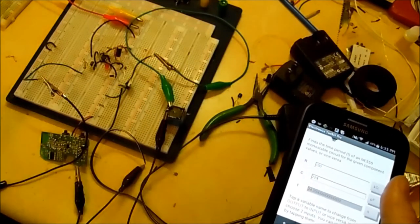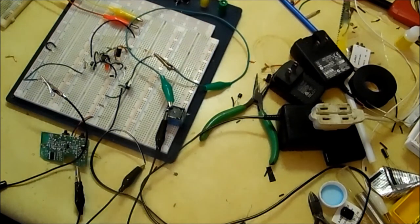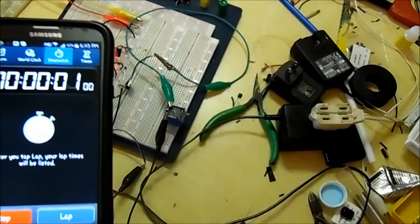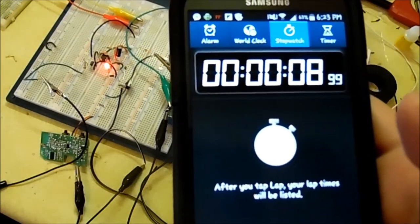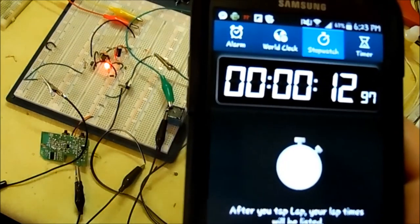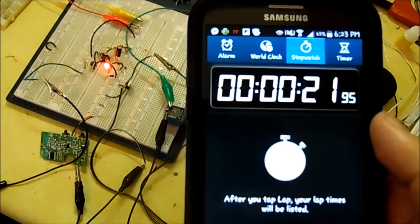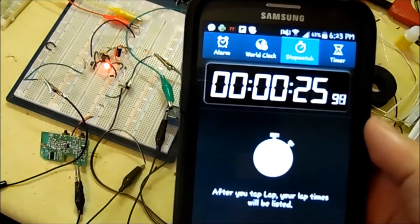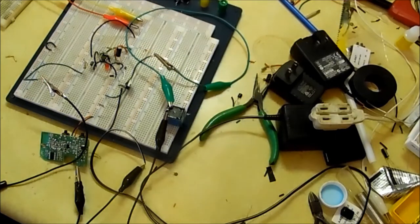With the added input from the speaker signal of the doorbell receiver, it gives a few more seconds. I'll time it right now — it should be right around 29 to 30 seconds. The doorbell sound prolongs the output because it resets the ground to the transistor at the last peak of the signal, so we should get a few more seconds. It came out to right around 31 seconds — perfect timing. I may add a piezo speaker to this so I can hear it working from a distance, or just add a switch.